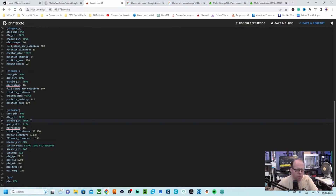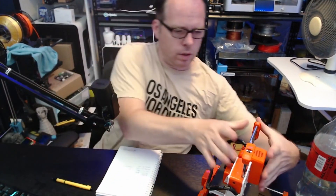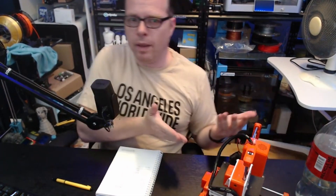I'm wondering what the bang does — it changes direction. What if I take the bangs away and see what happens? Save and restart. Startup looks fine. Let's check what the stepper motors do. I feel that the motors are energized even though there is no movement. That means the enable pin needs the bang — so let's change that back.